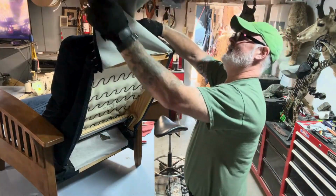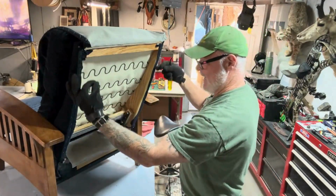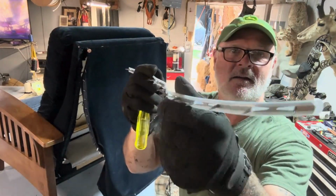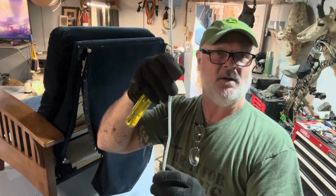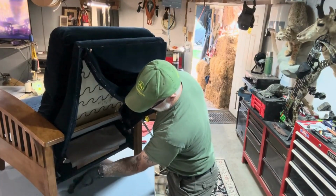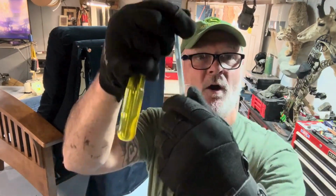Like I said, remember, on the top of any chair, it's always going to be a strip of cardboard that you start with. You tack that down, then you bring it down, and then you gauge where these metal strips go. You always want to have a plastic backing on them. You can buy them separately and they'll slip right on, and you cut them with your dikes to the length desired. Then you wrap it around and staple it, bring it down, and then tack it on the bottom. I'm sure you probably already know this, but these plastic things just slip right over like a sleeve.